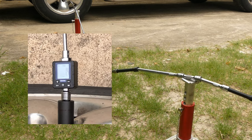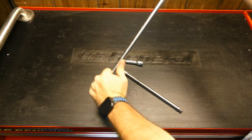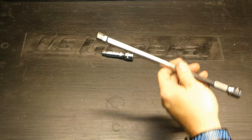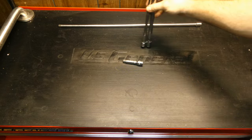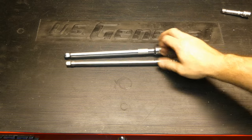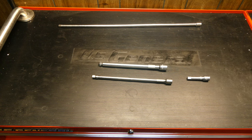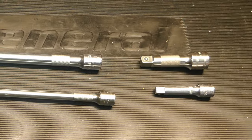So what was the result of all these tests? In my opinion, it didn't really affect the torque at all, no matter what extension was on there. The only one that lowered torque enough to talk about was the 24-inch 3/8 extension, which is pretty cheap and soft. But at these lower torque settings, it's not really an issue. Will the difference be greater when torque moves higher? I think it's safe to assume it would. But for everyday automotive or home use, use an extension and don't worry about it. The main factor when choosing an extension is just to make sure it's high quality and thick enough that it won't twist under a load.